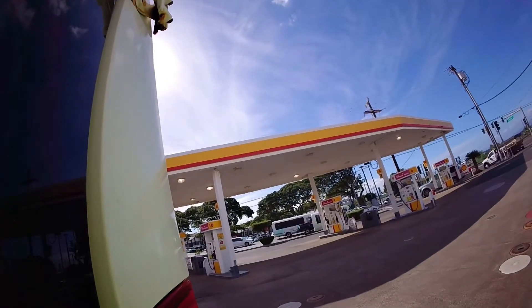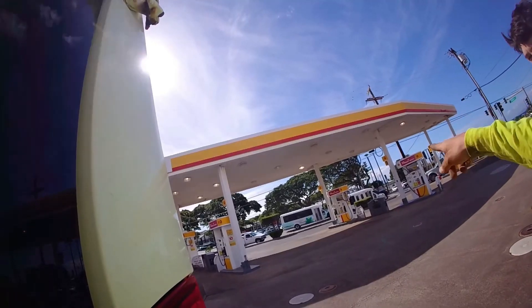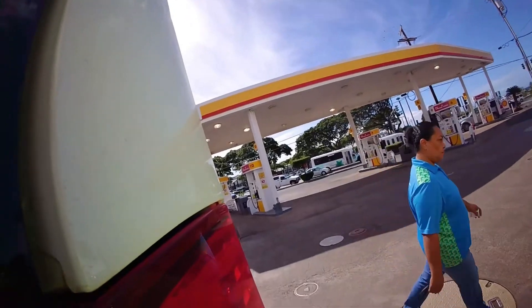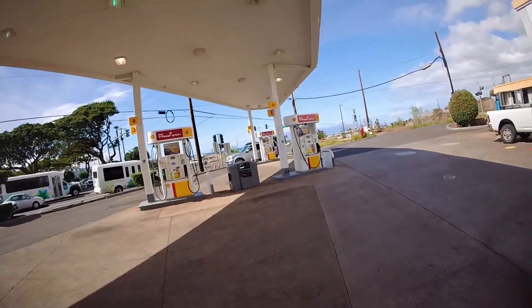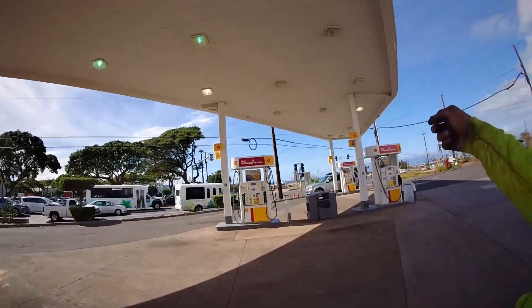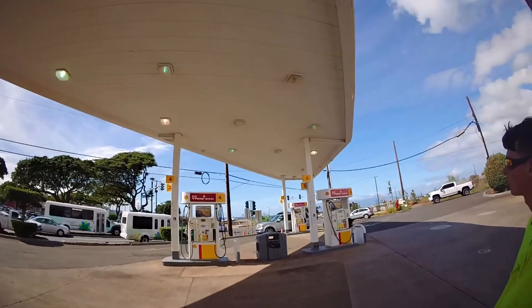About a year ago we got all the lights working — only two didn't work and we fixed them. Counting the circuits: one, two, three, four, five, six, seven, eight, nine, ten. Some of these are metal halide, so they take a little while to start up. The pattern at which they're out is going to give us a clue as to where in the circuit the problem is.